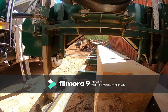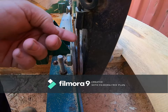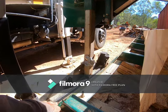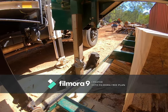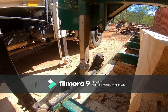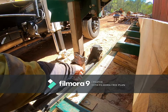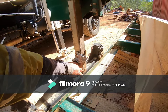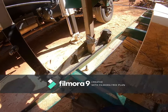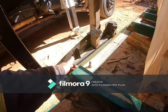The wheels have little wire brushes to knock the sawdust out and keep them clean. I've been running a banister brush on this side where the sawdust hits — though I may swap to a paint brush because I can get a paint brush more in line with the tracking. The banister brush kept wanting to roll and turn, ending up hitting the bunk stops as it went past.